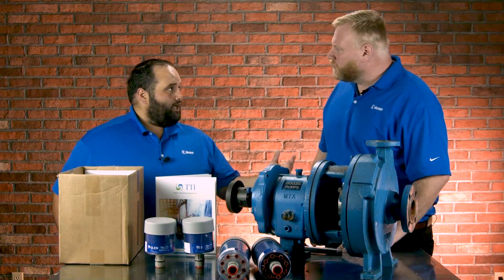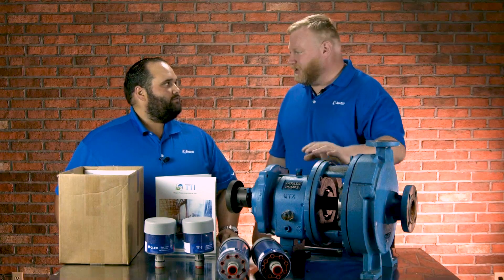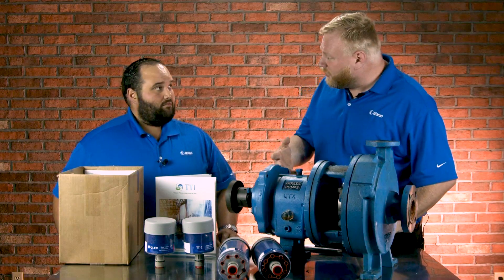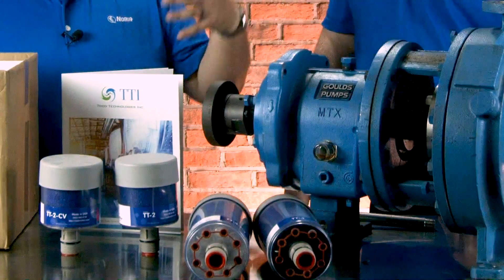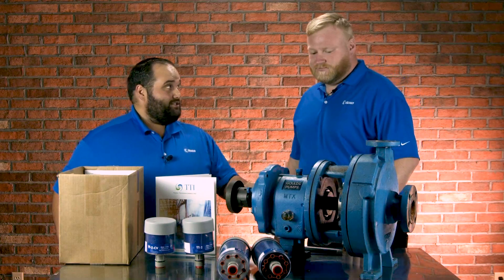So they're going to dehumidify and clean the air, because plugs like this don't do anything for us. This is typically OEM standard, and we want to replace these with a desiccant breather, cleaning up that system. With these TTI breathers, the rating is about three micron absolute. Not only are they drying the air coming in, but with a three micron absolute particle filter, they're keeping out stuff that is incredibly small and really damaging to the machine — typically the size we're concerned about within the film thickness range.